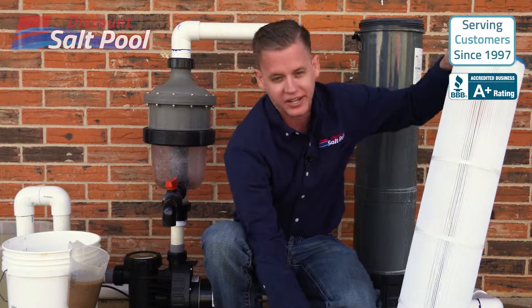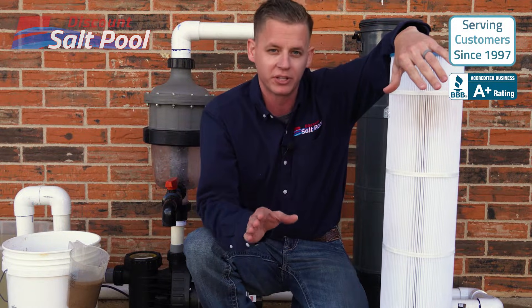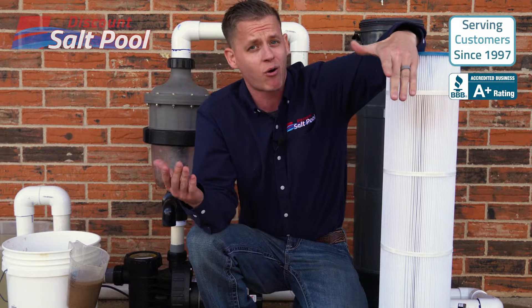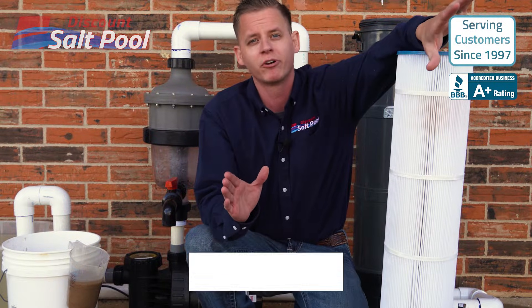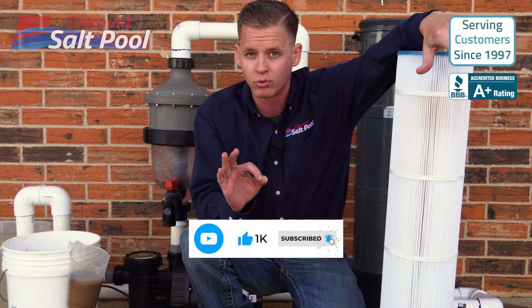I'd say a good 70% is what was collected. That's 70% of dirt and debris that would have reached your main filter had you not had a pre-filter installed. After we did take the lid off of the filter and pull out the grid, you can see that we found a little bit of sand at the bottom here. Sure, if you shake it around a little bit you can get a little sand to come out, but overall we've been very pleased with the results. So if you want to cut down on all the water you waste back-washing your sand filter, or how often you have to clean out your cartridge filter, or just all the hassle involved with DE filter maintenance — this pre-filter is an easy do-it-yourself add-on that works with virtually any pool.